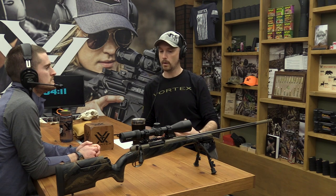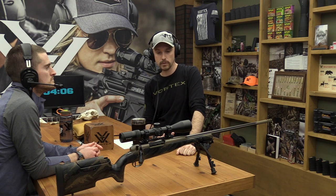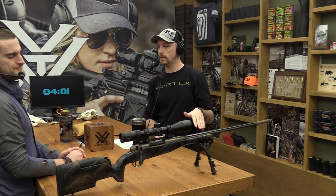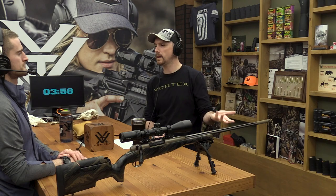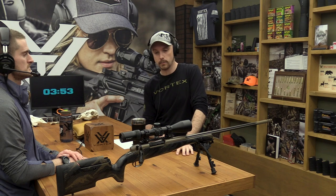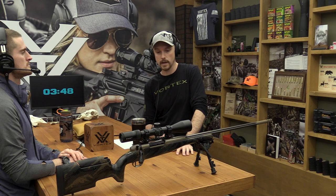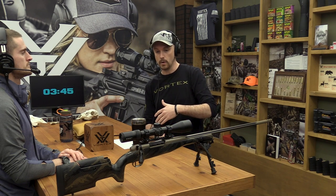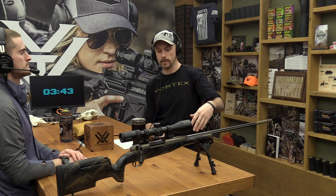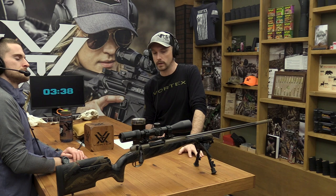Now, if we're going to go out and shoot long range, say 1,000 yards or 1,200 yards, or for the guys who are shooting 22 long rifles at 400 and 500 yards, you would need to do that, we would think anyways, depending on your rifle. You're going to need as much adjustment as your scope can give you. I've got a 6.5 Creedmoor Remington 700 that I use for long range shooting. I have a 20 MOA base on it because I want to be able to utilize more of that adjustment range in the optic and zero below that optical center so that I can dial it out. Same thing with the 22 long rifle, long range stuff.